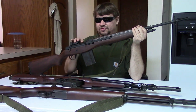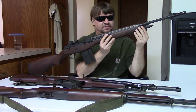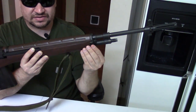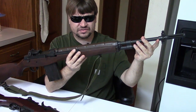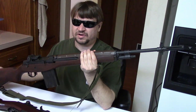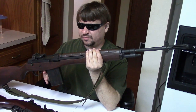They had to develop new tooling. The receiver was specifically made for 7.62 NATO/.308, so it's a different receiver. The gas system was shortened — it's now really a combination of the M1 Garand and M1 Carbine style gas system, with a piston up front striking the op-rod. The barrel went from 24 inches on the Garand to 22 on this. However, with the long flash hider and bayonet lug attached, this is actually a longer gun than the Garand — the Garand is about 44 inches, this is about 46. And even firing a smaller cartridge, once you add the detachable mag, this is the same weight or even heavier than the Garand.